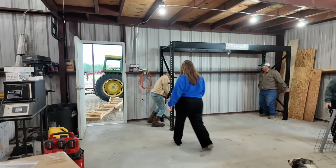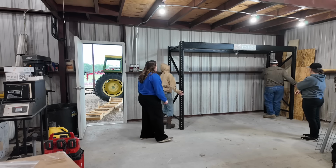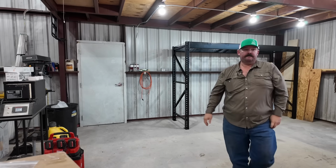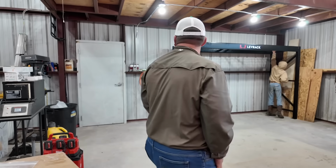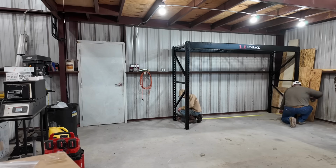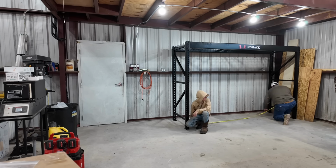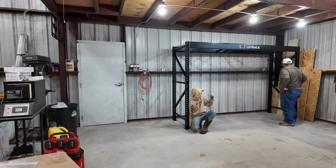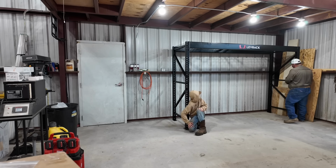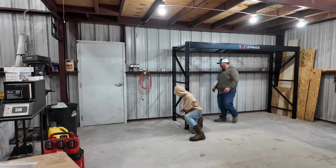Clarence, you ready? Right on my side. I lifted it really hard. I think we should leave a little gap down here. All right, we need to take a tape measure and let's check it for square. That'll make a big difference. Got it? Got it. 122, let's go right there. 122 and 3/4. 123 1/4. So it needs to go that way. So it's a 1/4 inch off. Why don't we push this one so we're closer towards the wall on this side? We didn't have that up against the wall, huh?